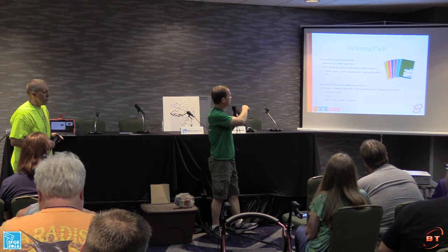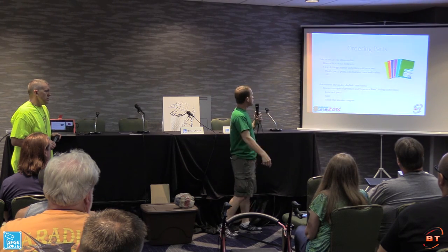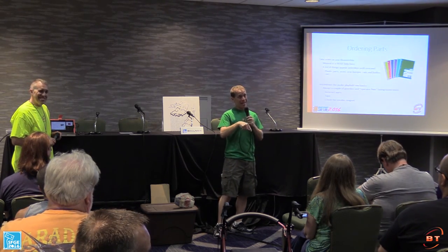Like I said, I like to go in and break down the under-playfield mechanics. So slingshots, pop bumpers, even if I just take them apart, take the coil out, replace the sleeve because they're inexpensive, wipe the dust out of them, and make sure everything's there. Check the speaker magnet, because a lot of times when anything falls off of the game, it ends up stuck to the speaker magnet. When you clean the game out, anything you find, any screw, any nut, keep it. What's the chance of someone randomly throwing a handful of hardware in there? It came from the game.